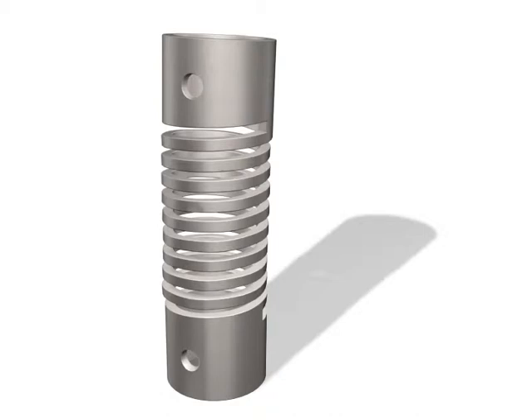Performance. Machined springs can provide very precise linear deflection rates because virtually all residual stresses are eliminated. Normal rate accuracy is plus or minus 10%, but we've regularly obtained plus or minus 0.1% for the more demanding applications. As a result, there are no internal stresses to overcome before deflection occurs, which can be the case in the wire wound spring.